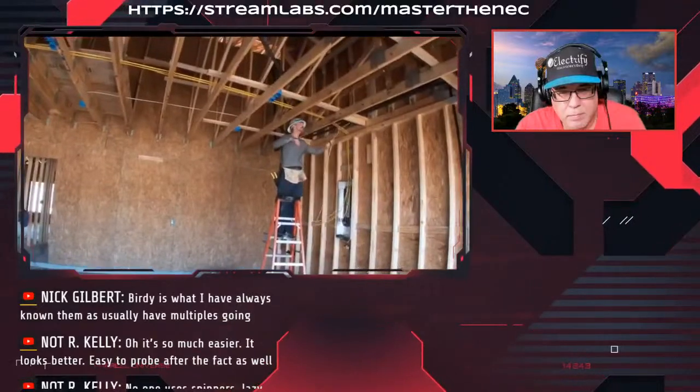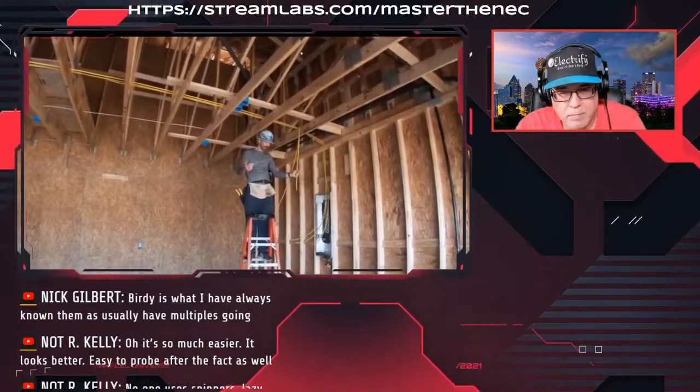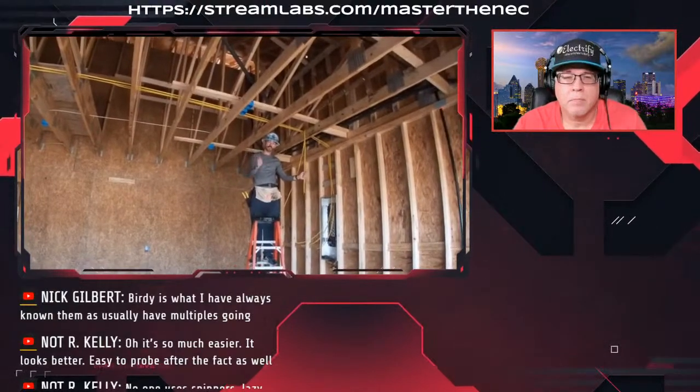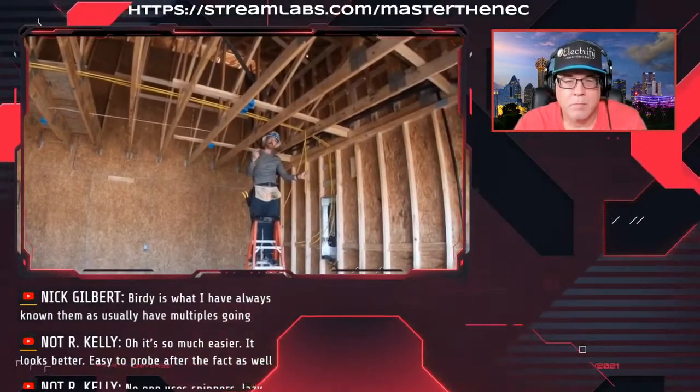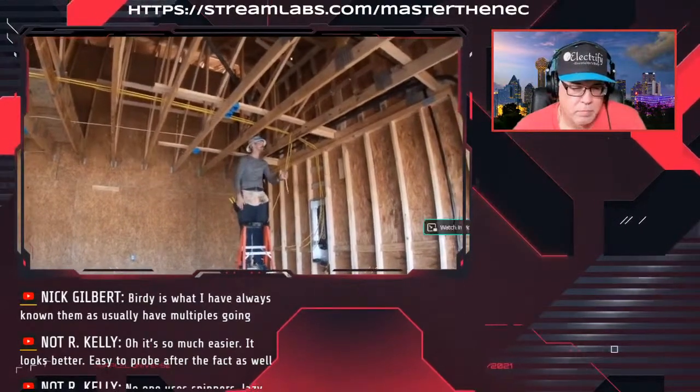So I'm taking this one to the dining. Also, with the dining receptacles, I put the nook, so it goes to the dining receptacles, the nook receptacles, the microwave, and the pilot light for the stove. It sounds like a lot, but...